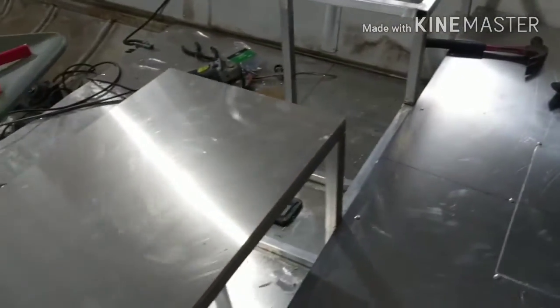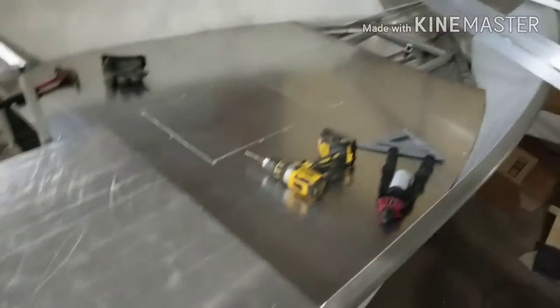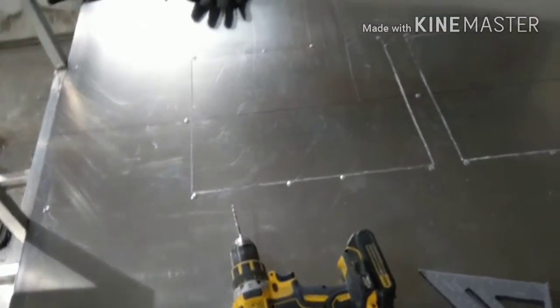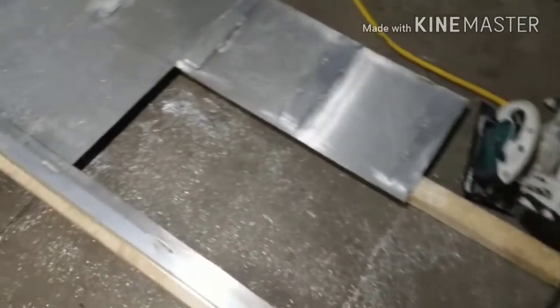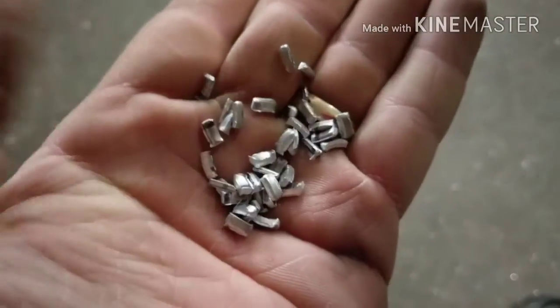Next step, I've started cutting some of the skin for the consoles here, a little one piece at least. What I use to cut out the hatch is just a regular skill saw. Normally I use an angle grinder with a cutoff wheel, and I think I like that way better just because the gap is a little tighter. But the skill saw was definitely a lot easier and you had less crap flying at your face. For cutting the sheets I also used a skill saw, which works really well. I also used this nibbler made by Milwaukee — it just takes these little nibbles, little chunks of aluminum. That works really well for doing straight lines and somewhat of a curve, but not too much.